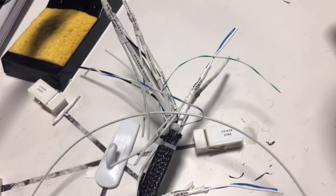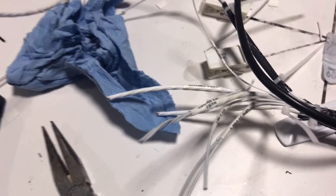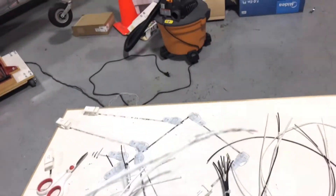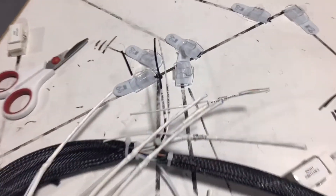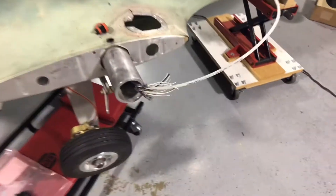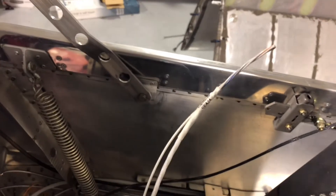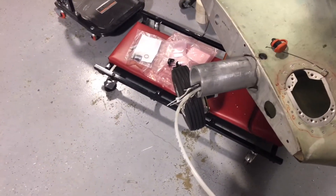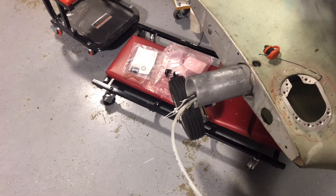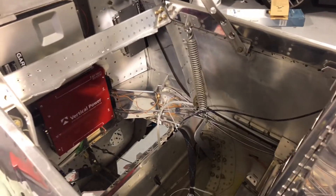Now, all the RS-232 lines — the serial lines that run up to connect the instruments — including this little one that goes between the GDU-460 and the GSU-25, just like the instructions said to do. I've also got the CAN bus line that goes out to the GMU-11 in the wing, and then it runs up to the GEA-24 from the wing side. Those are the two wiring harnesses that need to be joined. As soon as I finish the little bridge to go across to the left wing and button that up, I'm actually ready to put the wings on — but I'm going to wait until I get the rest of this wiring harness done inside.